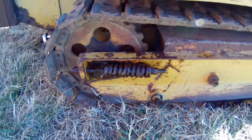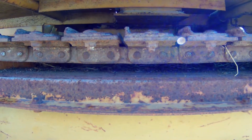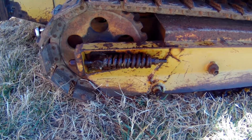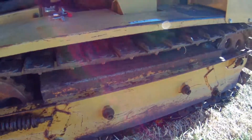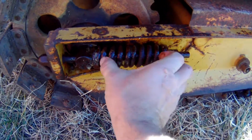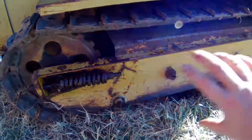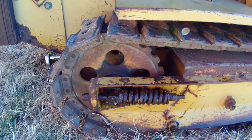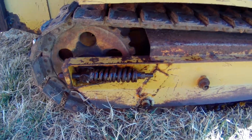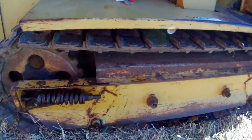Like I said, I did get it tighter but that's all the adjustment I had, so it's gonna work for a while. Later I'm gonna have to come back and do something - I need more adjustment than I got, but I got all I could get today. When you do this, just hold on to that and tighten it up, compress your spring, and that pushes forward. Then you back your tracks up and it'll settle itself. I got quite a bit more than I had but not as much as I wanted - hopefully you'll have more adjustment than I did. Anyway, that's how you adjust the tracks on it. Like and subscribe and I'll catch you on the next video. Bye.